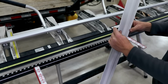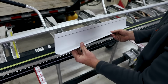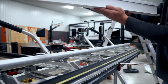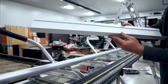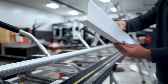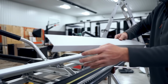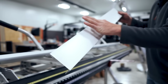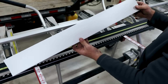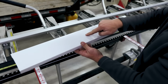And look at that, you just created a piece of fascia. And so that's just gonna have a nice 1.5 inch bend. It's gonna cap up underneath your, or over top of your soffit and cover up your fascia, nice and clean. It's got those nice hems. That way it's nice and stiff. You see that? It's not gonna get any of that oil can in between the flat here. So the bigger this area is, the more chance of an oil can.